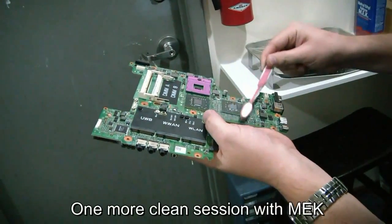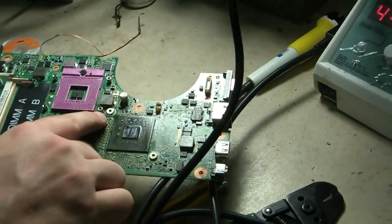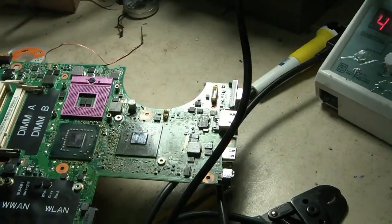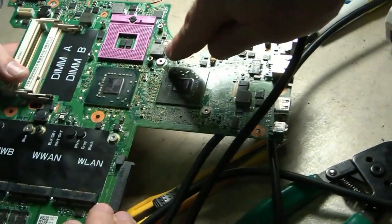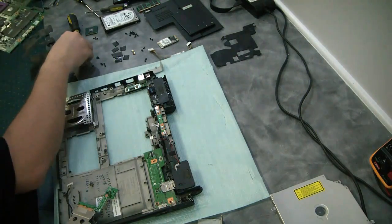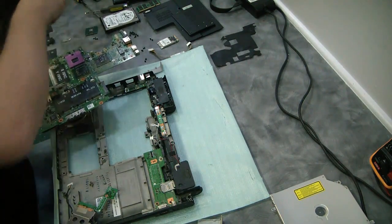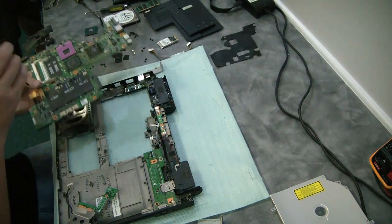We're looking at the rivet right over there. Trey just re-soldered that back into the board — that's what actually came off the board and caused the heat sink to move to the side a little bit, which helped it overheat. Soldering this down with good solder is going to help it stay down. We're also going to put copper on that to drop the temperature so it doesn't overheat in the future. Right now he's going to put all the basics back together just so we can test it to make sure the reflow was successful. We'll put a little bit of thermal compound on that and the copper with the heat sink, and test it out live.